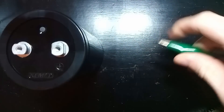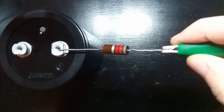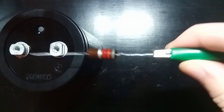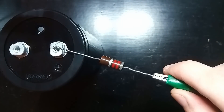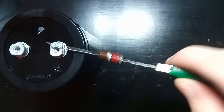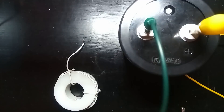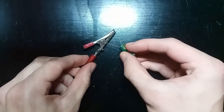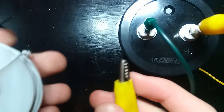I need a way to safely charge up this capacitor and then connect it to the coil. When I was charging it for the first time, I was using a resistor connected to a clip lead to touch the positive terminal of my supply to the capacitor. By doing this, I'm touching the rubbery material of the clip, isolating myself from the voltage going into the capacitor. The resistor lets me limit the current going into the capacitor, which charges it slower — I do this in case something goes wrong so I have more time to react. Connecting the discharge leads directly isn't a great strategy either, as the spark at 30 volts was already quite bright and hot, and higher voltage will only make that worse — at some point it's going to melt the wire.